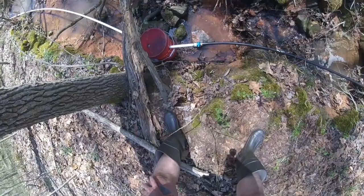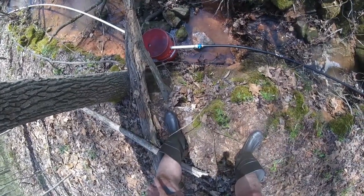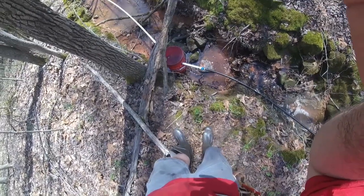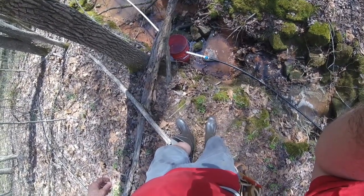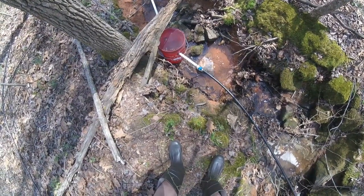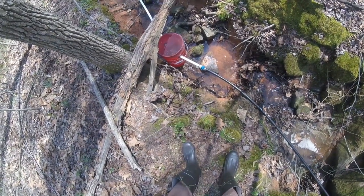Yeah, see that, the problem is the flow from the feeder pipe. The flow is as fast as it's going to get, but the drive pipe, I think, is just sucking too much. I'm going to close it off again because I think the drive pipe, as long as it cycles, that pipe should stay under the water. So let me try that. Got it cycling again. It looks like there's no air, and the bucket level is way above the drive pipe.